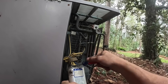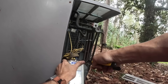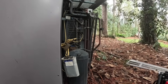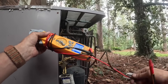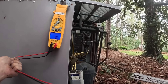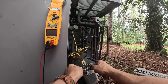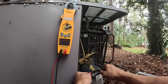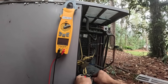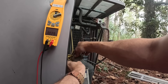Common is going to be in the middle — that's going to be my 5 and that's going to be my 60. But as I've said 100 times before, that's not actually common, that's run. The capacitor is always between start and run. Let's put this over here on microfarads: 4.7 — good enough to make it run — and 60. I ain't going to complain about it.